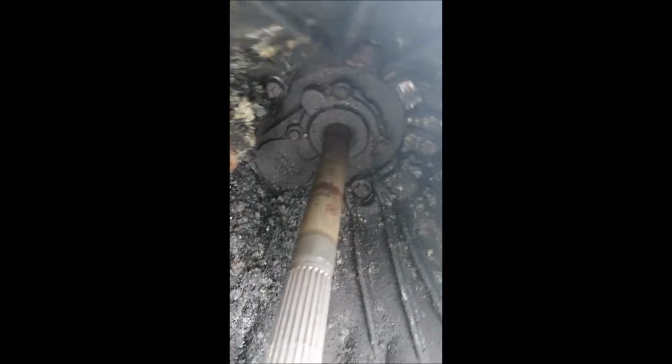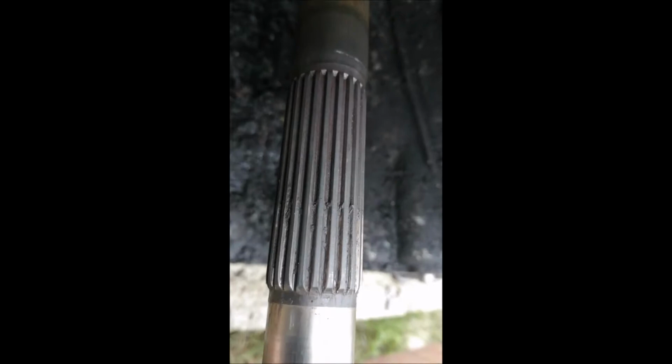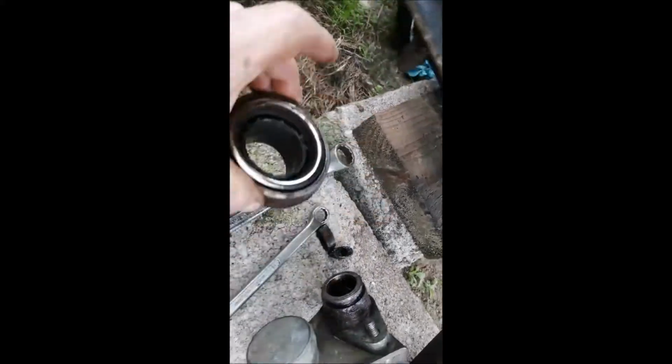Right, so here's the shaft. It's a remarkably long shaft out of the R380. I assume that's the oil pump there at the front. Generally that's how they work. It's full of crud, but the shaft is pretty good. No major wear problems on that, I don't think. Of course, it's quite a long bell housing, I suppose. This release bearing here is a plastic cheapo thing, really. I don't know whether they're all the same, but it doesn't look like it's made to last.